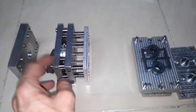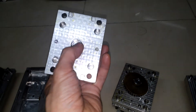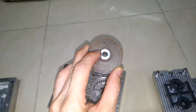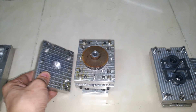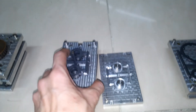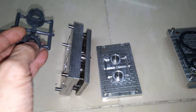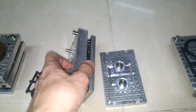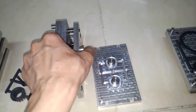The sprue is here — material goes here. You can see there are four gate points here. I haven't included the sprue here, I misplaced it. You can see the ejector pins around here and also inside. This similar structure — the core here is also tiny. You can see the core pin here is attached to the ejector pin and it will push up here.